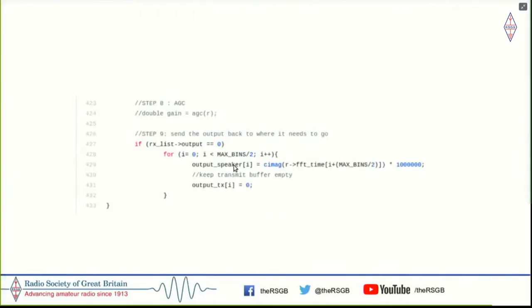And then you just take this, multiply it with the gain. By the way, you control the volume of your signal by just multiplying it with a number. If you multiply it with zero, the gain becomes zero, and the speaker is muted. And if you multiply it by one, it is maximum. So stuff like that. It's a fairly straightforward thing.